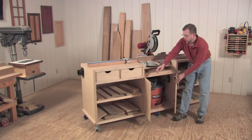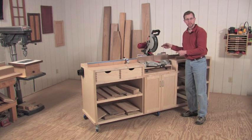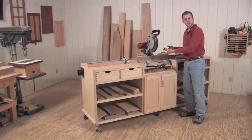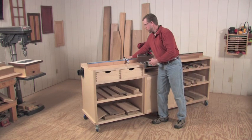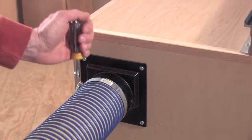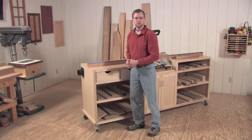It's really helpful. Aside from that level of dust collection, though, you're still going to get some residual dust that even the vacuum won't collect. On this project, behind the platform, I've designed a trough that collects that extra dust and draws it through a four-inch hole in the back of the cabinet through a dust port on the end. So you can hook up your four-inch dust collector hose with a blast gate and draw the extra dust out whenever you need to — whatever the shop vacuum doesn't collect.